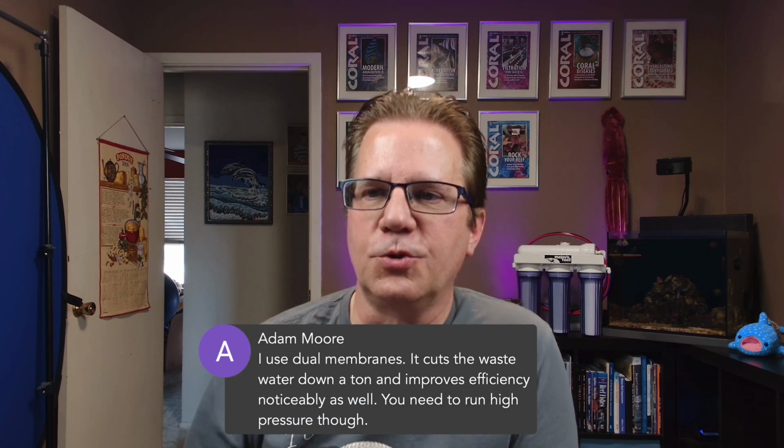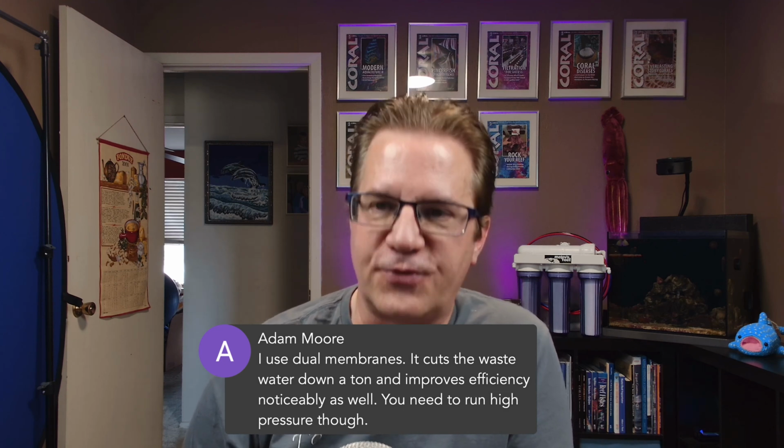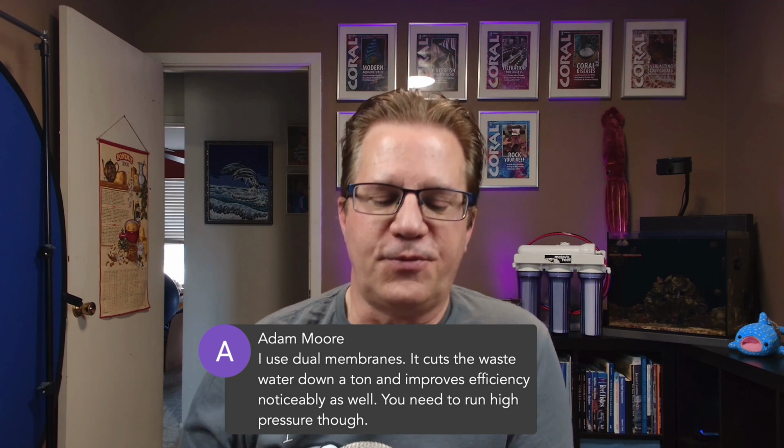Adam says, I run dual membranes because it cuts down on the wastewater a ton and improves efficiency notably as well. You need to run high pressure though. If you can get your water at 80 to 100 psi, you can definitely run 2 membranes, and you can run the second membrane off the waste line of the first membrane. So like you said, you're utilizing the wastewater coming out after that flow restrictor. But that's a whole other project, and I don't have time to get into it.